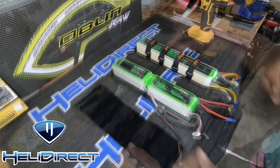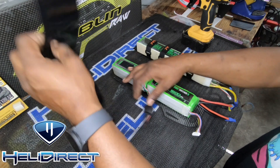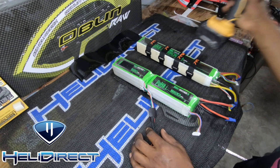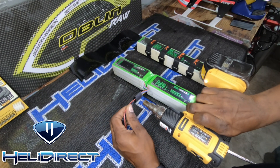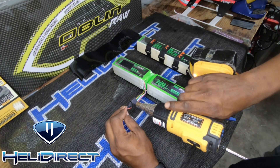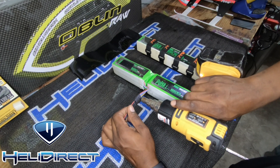Then you get it pulled out of your battery, you have to open it and solder it, so we're going to try to avoid that. I've added the heat shrink here. I'm going to move this away because I don't want to shrink that accidentally, and we're going to come here with the heat gun, turn it on, and shoot it to the side. You get a nice clean wrap — look at that.